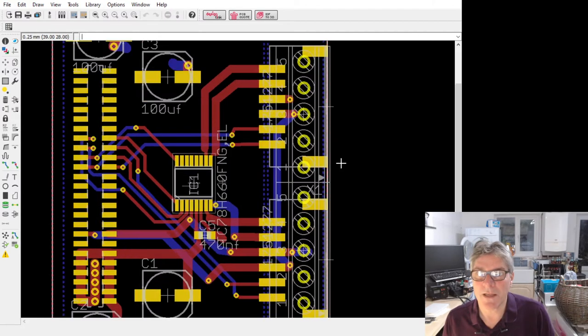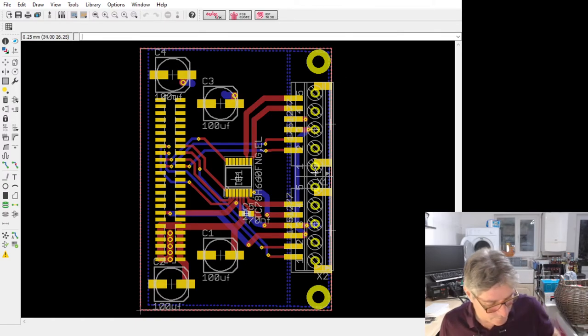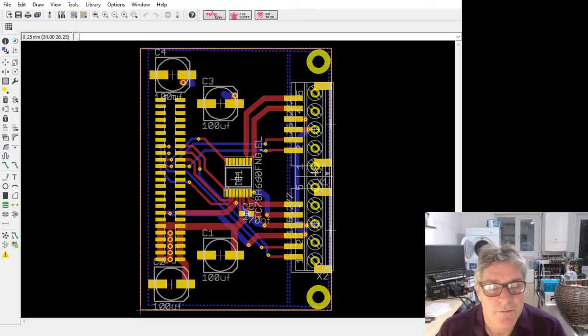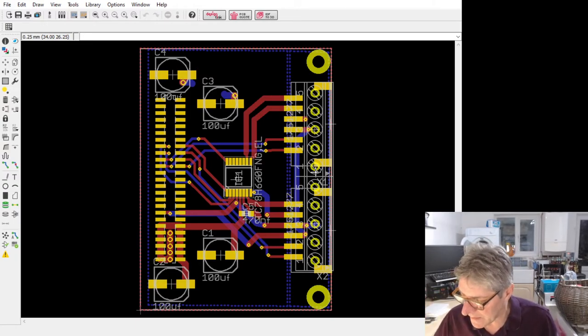Anyhow, quickly back to here. So we could put the terminal blocks on like that. And the plus and minus, the ground and 3V3 would be shared, the two motors. I think that would be okay. It's only low voltage. Mechanically, that's not always the best idea to do. If you put two wires into a screw terminal,